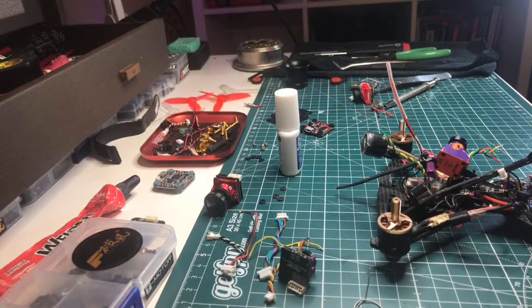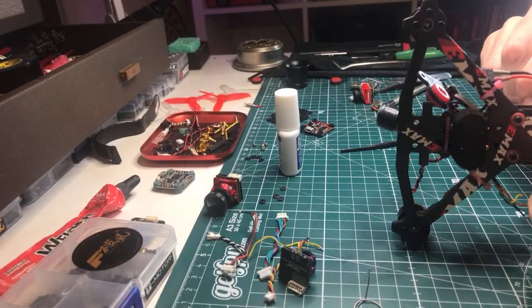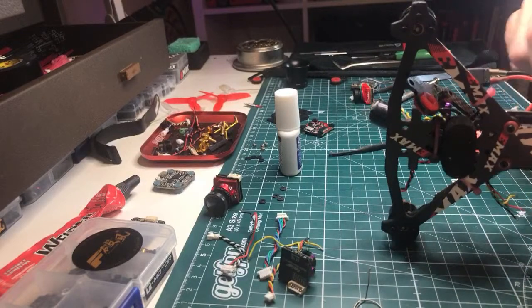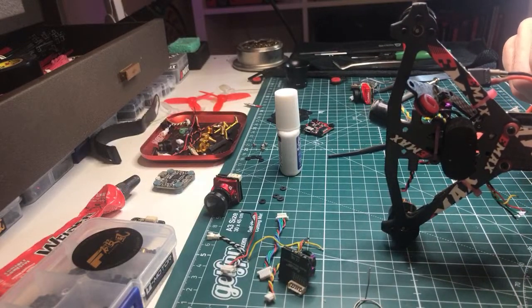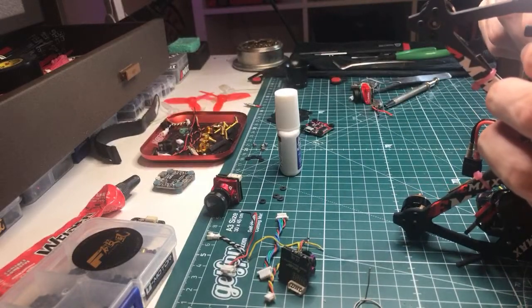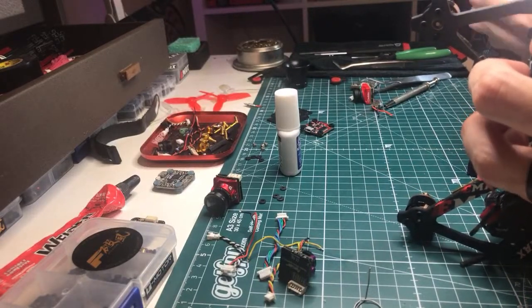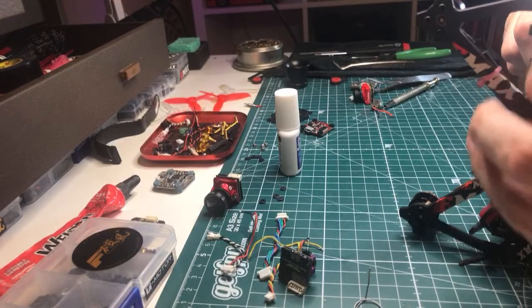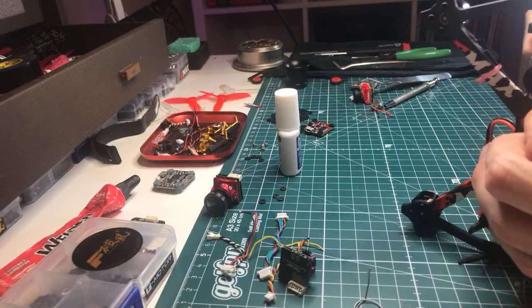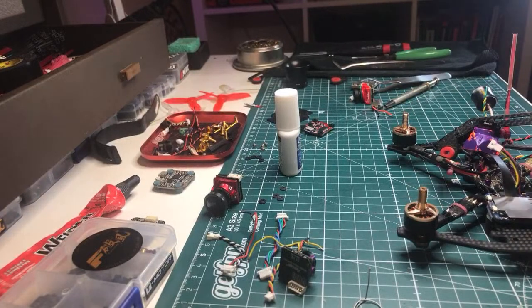I really, really try not to tune mechanically screwed up setups. Not mechanically screwed up, but I think you know what I mean. Just mechanically handicapped setups. I don't want to try to tune around that. I want to find gear that's going to work on a stock tune, basically. And then I can tweak it to be exactly what I want. With the exception of some really high power stuff, a stock tune should be pretty damn good. Stock tune should fly really, really well. And if it doesn't, I tend to look at mechanical things before trying to tune around it.